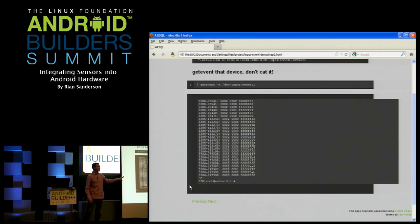Now that doesn't look like an Android sensor reporting 9.8 m/s² for gravity — that's a big job of lib sensor: to convert those driver values into floating-point real engineering units. What can mess you up is if the driver is in, say, a 4G mode but the accelerometer supports 8G and 2G modes. If the mode has been changed, that conversion factor changes — so it's something the HAL has to keep track of if you're going to switch ranges or do anything unusual.